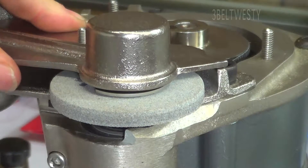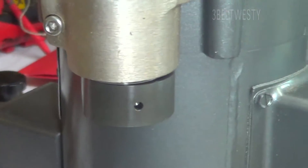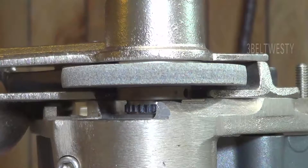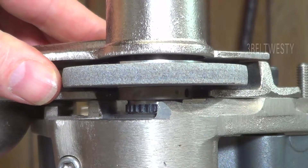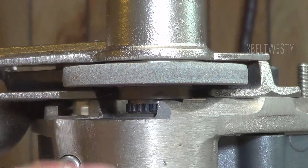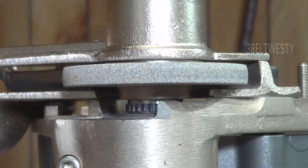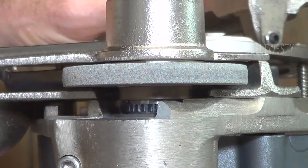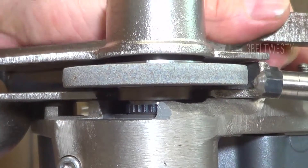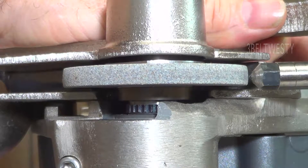It all lines up correctly. Here's a side view — I've got the camera at about the same level — and I've dropped this so the bearing cartridge is flush with this edge. Now when I put the diamond dresser on here, lo and behold, it will hit the equator of the grind wheel just where it should be.